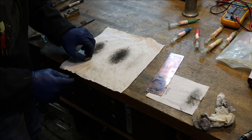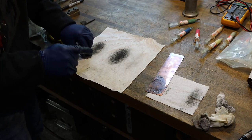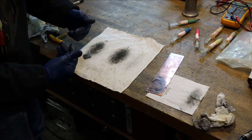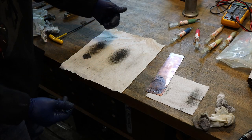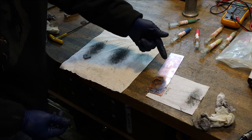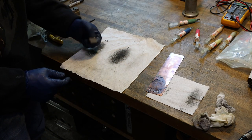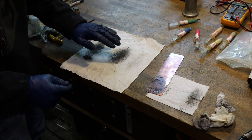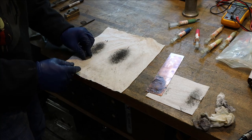So I've moved over to a paper towel for the final one, and then the 0.5 micron. And the reason for that, at least what I've experienced, is the 1 micron and the 0.5 micron don't seem to cut very well when you put it on a hard surface. Because it's suspended in oil and I've got a part that's flat, when I move it back and forth, it really seems to just get up on that oil film and not get cut by the diamond.